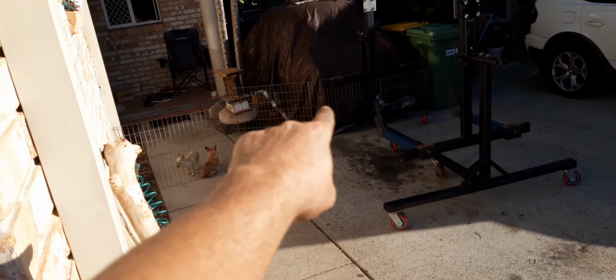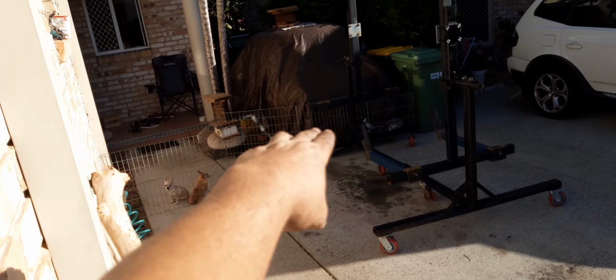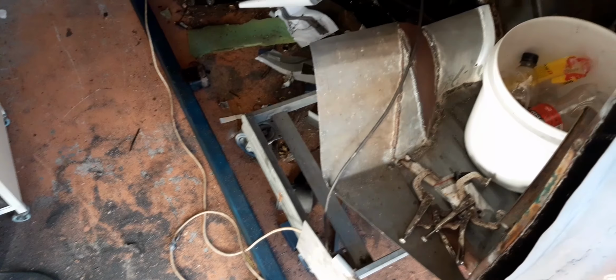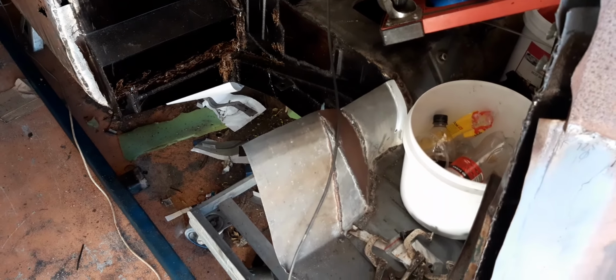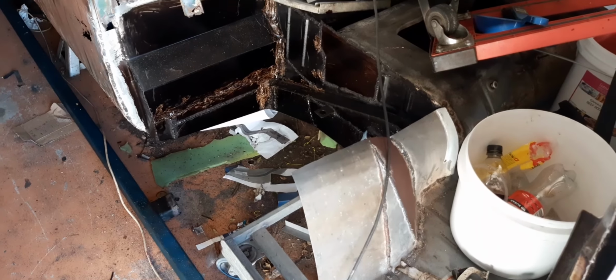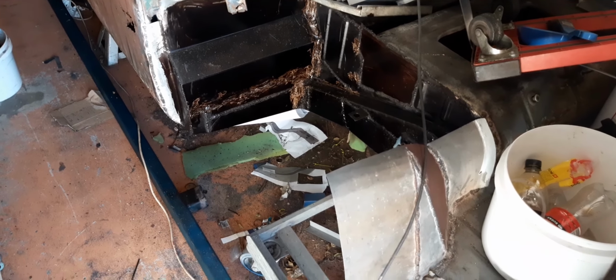And that's what I did with this other car out here, the one that's under the tarp there. The bottom 1.5 feet of that whole car has all been handmade, all brand new steel, all zinc anneal, and it's twice as thick as what it came from in the factory, and that will last a long, long time. So no little patches here and there for me when it comes to framework.